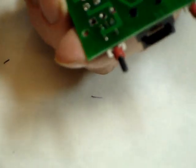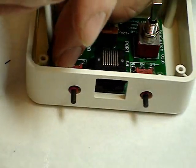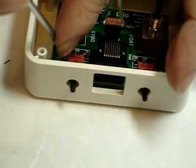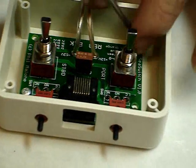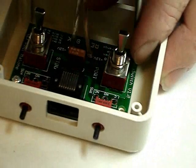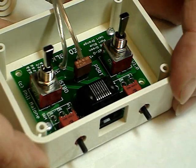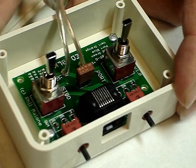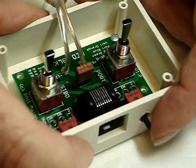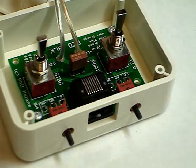At this point you're ready to go. Before you actually power up the unit, it's best to check it first — I like to put a couple of screws in before checking. The easiest way to check for any short circuits on the board is to hook up a continuity meter or ohmmeter on the two power conductors and then simply activate the switches. If a short occurs between the plus and the minus, you know that you have a short on your board. Once you've done that test, you can continue to put the circuit board in place.